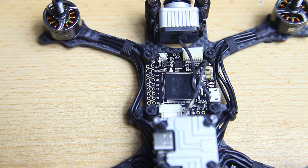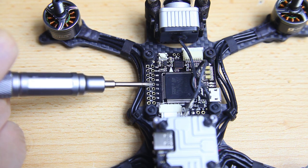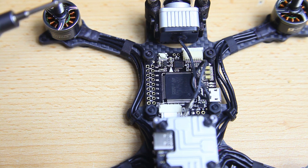And yeah, you'll have to have a look at your flight controller, which is easiest. Again, you'll just need power, 5 volts, and the T portion of the UART you want to be using for your receiver. Again, I'll be using T2, UART 2 for my receiver today.